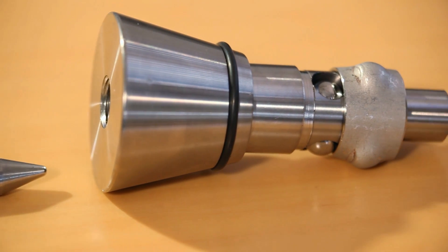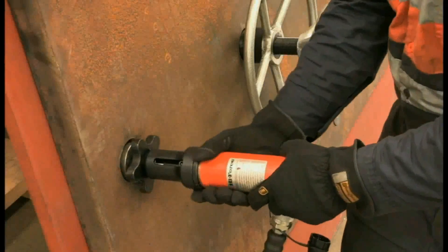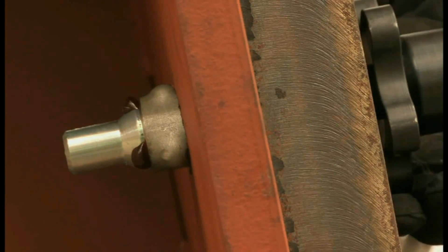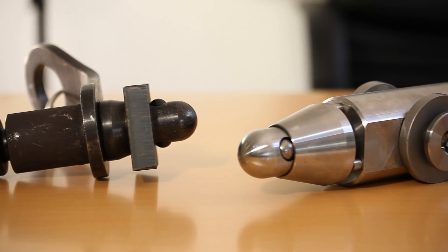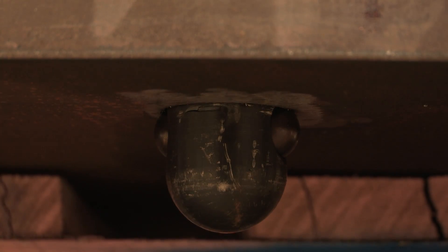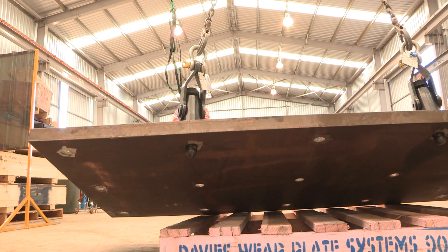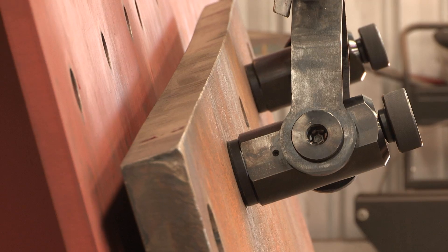An alternative nutless bolt design is also offered, which enables quick, safe and single-sided attachment and removal of wear plates, eliminating the need for access to the rear of the equipment surface. Adding to the safety benefits of the system was the creation of specialised lifting and handling tools, which utilise the hole shape and nutless bolt principle to create a safe method for handling, installing and removing large or small plates of any hardness.